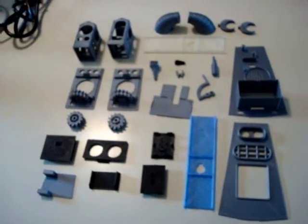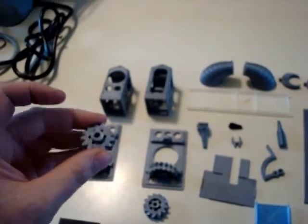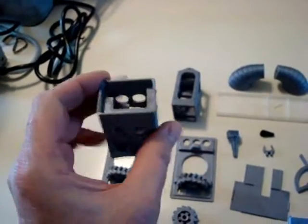There are 25 3D printed parts — that's 18 different files. The first thing to work out was the gear drive for the back feet. I took the regular foot but then added these nice funky looking gears, made up with the servo and the leg. I modded the leg slightly, added a notch for making it easier to slide the servo in, and a little thicker wall to screw into.